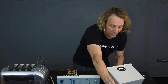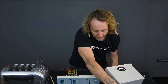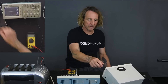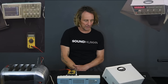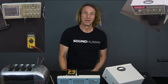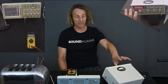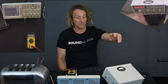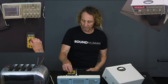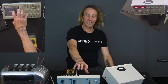Now this amp's going to be a little noisy — we'll hear some fan noise from it, but I'll talk over it. I'll plug this thing in and get it to juice up here. Now you should be able to see the scope here, and I should be able to see the function generator here. So to power up this toaster, I'm going to need to recreate 120 volts, 60 cycles. I've got 60 cycles on the tone generator, and I'll take a 60-cycle signal and run it into the input, then generate 120 volts output, which will be measured on this multimeter as well as on the oscilloscope.